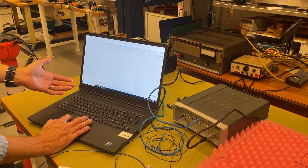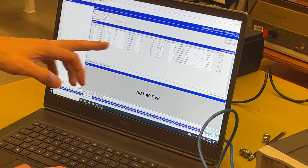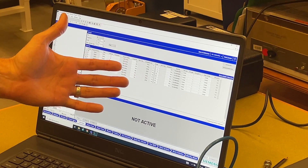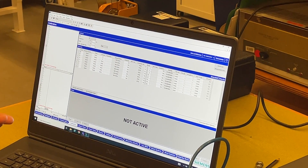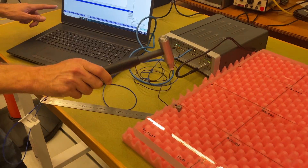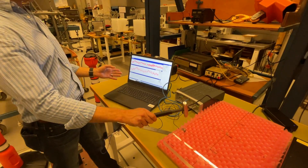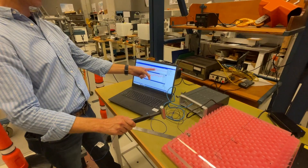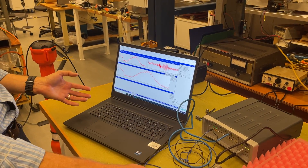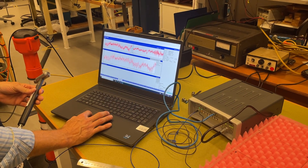Then we can look at calibration setup — we want to calibrate our transducer and get the relative sensitivity, because in the channel setup sheet we can define sensitivities. We've done a lot of that. Then we can go to the impact scope sheet. If I've done things correctly and I'm using a free display limit, when I do an impact you can see impact response. It's happening quickly because I'm not yet triggering, but that's just checking that my channels are working. I'm going to go around the plate doing an impact, collecting the response, and that will give me an FRF.